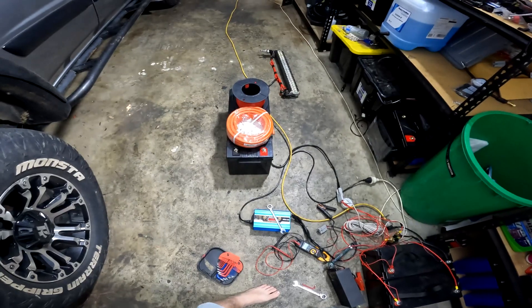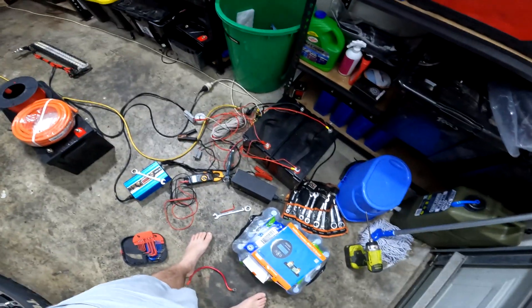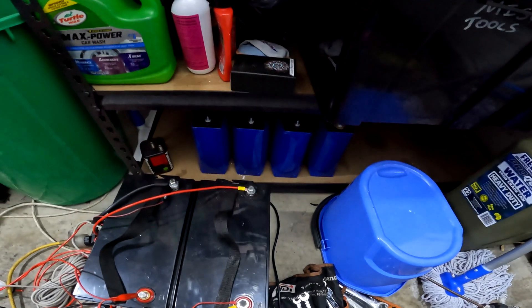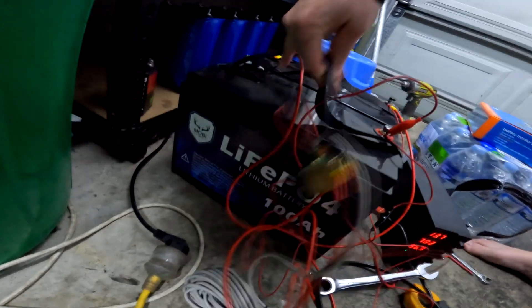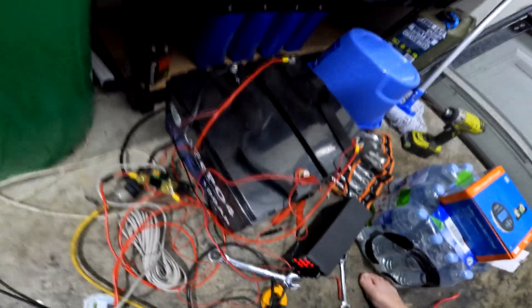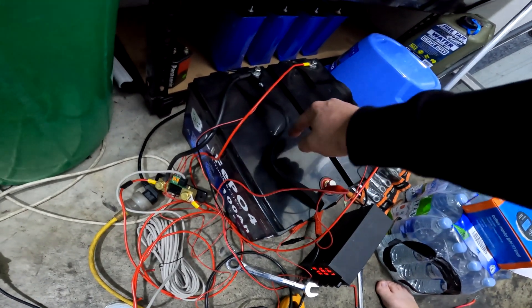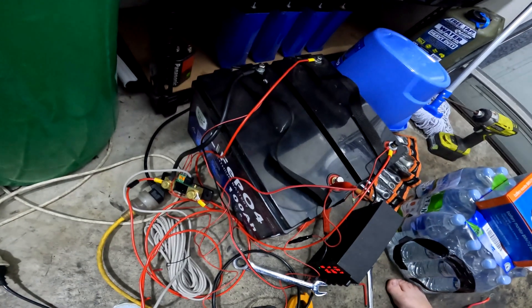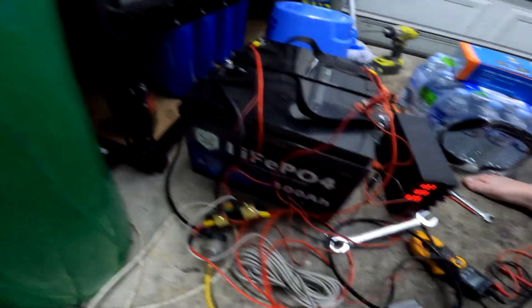I've just finished building that 280Ah battery and can't wait to get that sorted. We're going to abuse these batteries in the next video - those pregnant cells. I hope you enjoyed the test. Here is the type of battery - you see them all over eBay. These are the dodgy ones guys - don't grab them. They're literally half the capacity. Over 500 days, one thing I will say going for them is they're still exactly the same capacity as when I put them in originally. Do not get them guys.